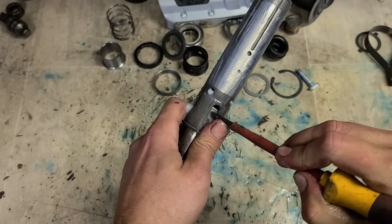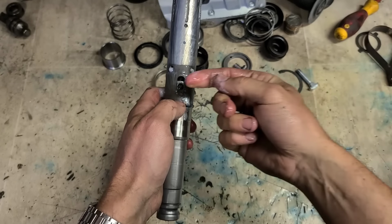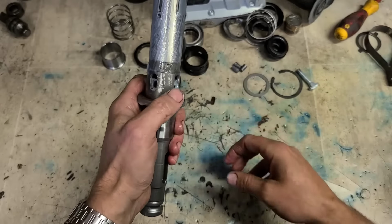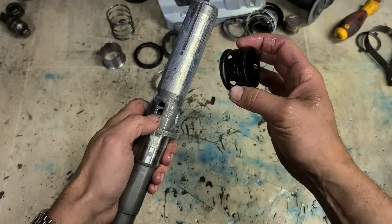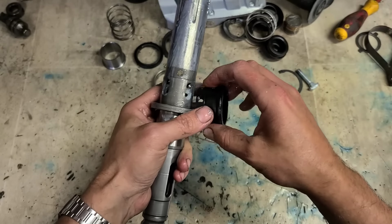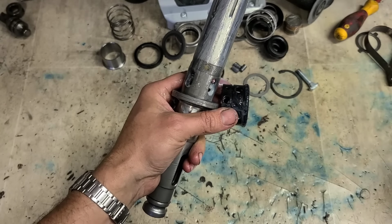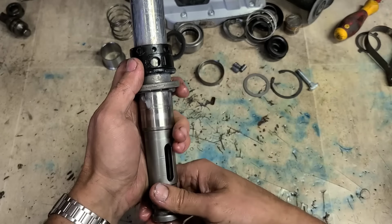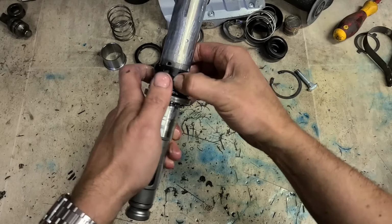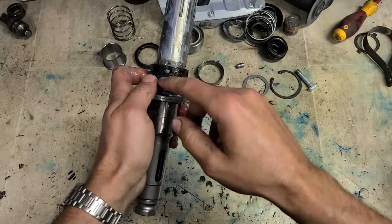Push it down and just locate the holes for your steel bush, have them facing towards you. Bring the ring over the top, and then this ring goes over the top of that. Obviously the wide end goes to the bottom, although there should be no way to get the steel ring over the top to lock in them pins. Stick that on, put your steel pins in through it to locate this plastic sleeve under the steel bush on the inside.